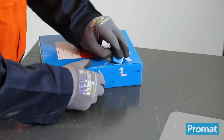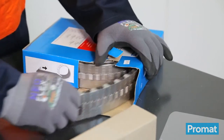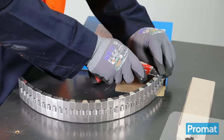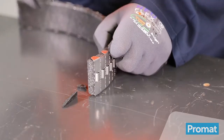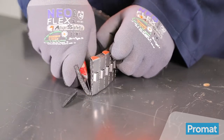Open the Unicolor box at the position clearly marked with an arrow and remove the box of accessories. Pull a sufficient amount of strip required for the collar. Cut through the Graphitex using a sharp knife, then bend the stainless steel outer casing at the cut mark until it snaps. Chamfer the Graphitex at each end of the strip to allow for a tight fit once the collar is formed.